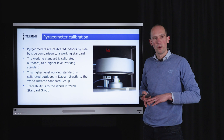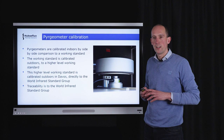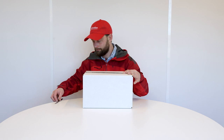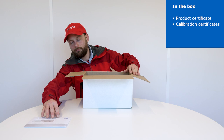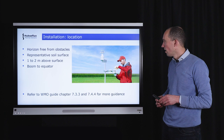That covers the theory on net radiation, the product components, and calibration. Now we move to the second part — installation and how to measure. To unpack the NR01, cut the tape and open the box. Inside you will find an envelope with one product certificate listing individual sensitivities for the four sensors, two calibration certificates, two hex keys for easy mounting, the NR01 net radiometer with cables attached, and a shim for mounting on three-quarter inch pipes — remove the shim when mounting on one-inch pipes.